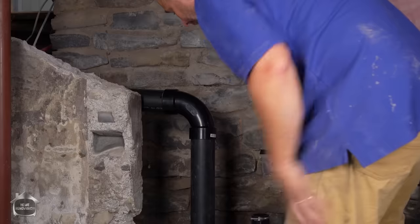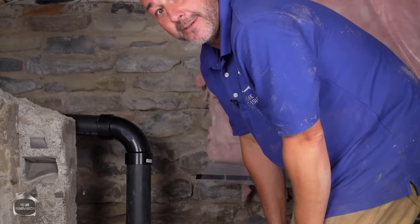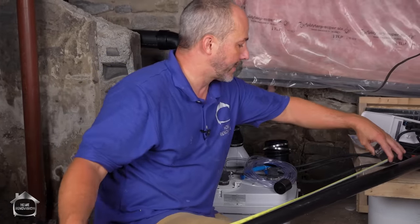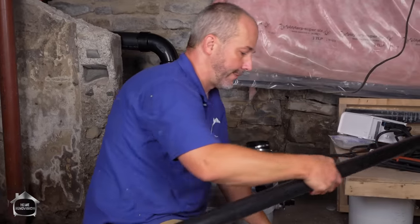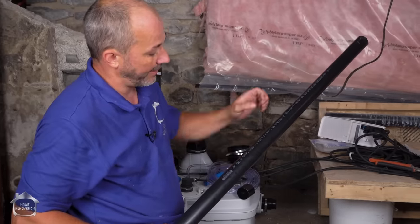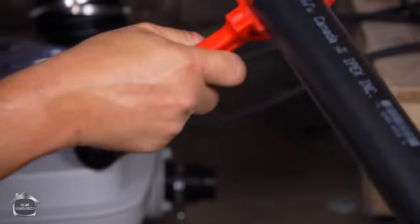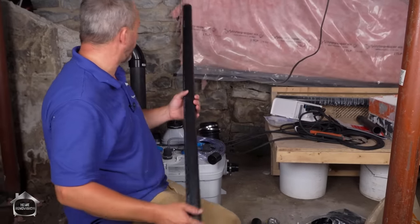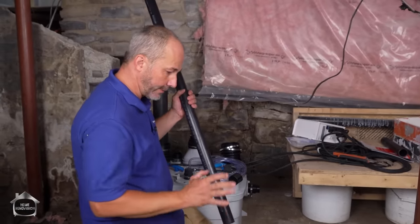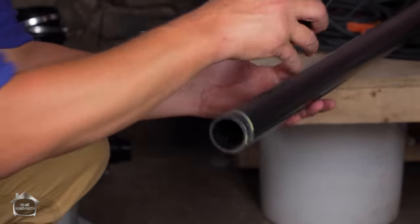Let all that glue set up — it's hot and humid in the basement. I can't wait to get that new furnace and air conditioning system installed, but one thing at a time. So working left to right — now it's time to connect our vent. We've just got a measurement of 45 inches. The cool thing about this pipe is it's full of print, so once you measure you can just get a mental mark of where to put it. I'll pull up my little cutting tool — it has one tooth on it — and there we go. Nice, no burrs, it's perfect every time. This is not a glue joint down there, it's just a clamp, so I'm going to glue my elbow on it now before I get it set up in there.